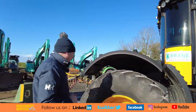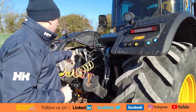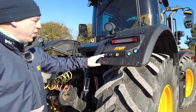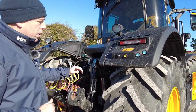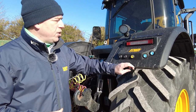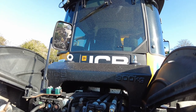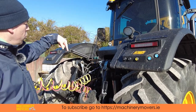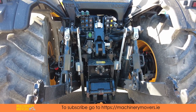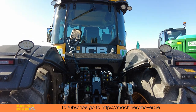We walk to the back of the machine and this is where we have the hitch. We've got our airlines here and also we have our controls. So for example, if I want to raise or lower the suspension of the tractor, I can just press those buttons there. That's for our PTO and this is for our link connection here. And we have a nice little access mirror there, so when I'm sitting up in the cab I can look back and see all that's going on. Everything is here and we also have a big counterweight — 900 kilos — again to keep it nice and steady.